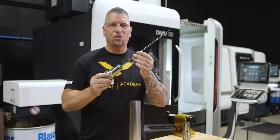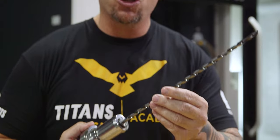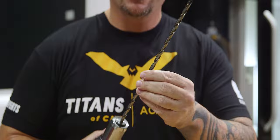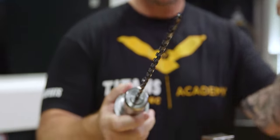And there you go, the SGL drill, 40 times diameter, no pecking, in stainless steel and high temps. It's the greatest drill I've ever used, and I've used all of them. It's amazing. Boom. So what I did was actually hand code the drilling cycle.